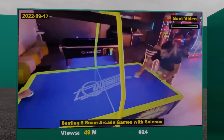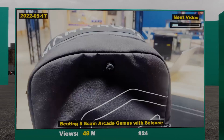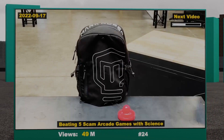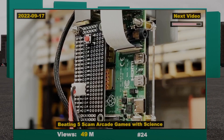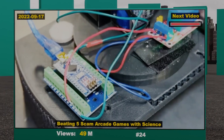We've got the perennial arcade favorites, air hockey. This is the most complicated of all the builds, because if you look closely at the top, there's a hole in the bag for a camera to look out through. Stripping away the backpack, you can see that camera connects to the brains — in this case a Raspberry Pi, which is basically a mini computer, instead of just an Arduino microcontroller like all the other builds have used.